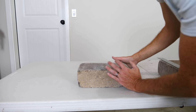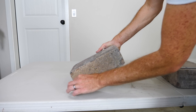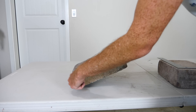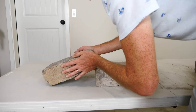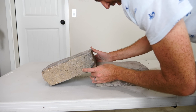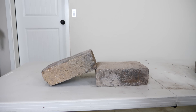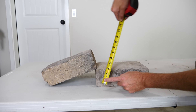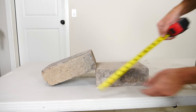Initially the edge is here, but when I lift it up, see how the edge now comes over. And depending on what angle you lift it up, it makes this edge come over more. So if we lift it up the height of one brick — just barely right on the edge — that means we should get a triangle that has one side that's three and a half inches and another side that is ten and a half inches.